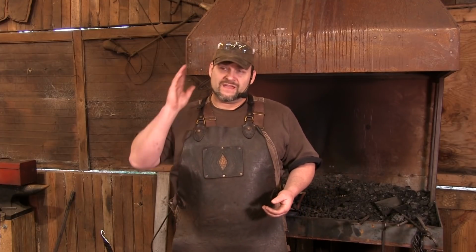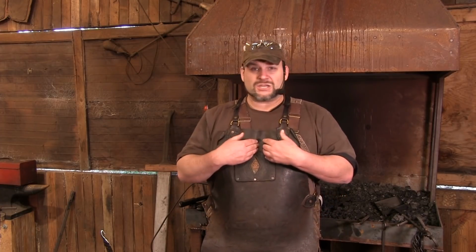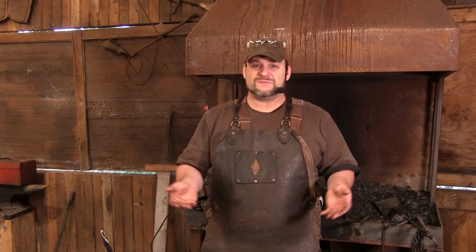Now, in my shop, the main tool that I have is an Evolution metal cutting saw. This is basically a chop saw. It looks like a wood chop saw, except it has carbide teeth and a lower RPM. I can very effectively cut through 1-inch square bar. But again, these tools are $400 and $500 apiece. They're professional grade, and they make a tremendous difference. In my shop, there is no way I would be able to produce anything in any reasonable amount of time if I did not have the professional tools that I do.